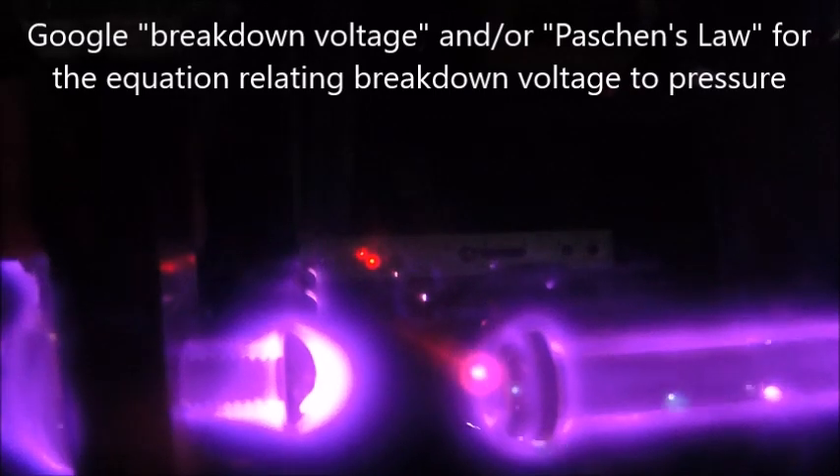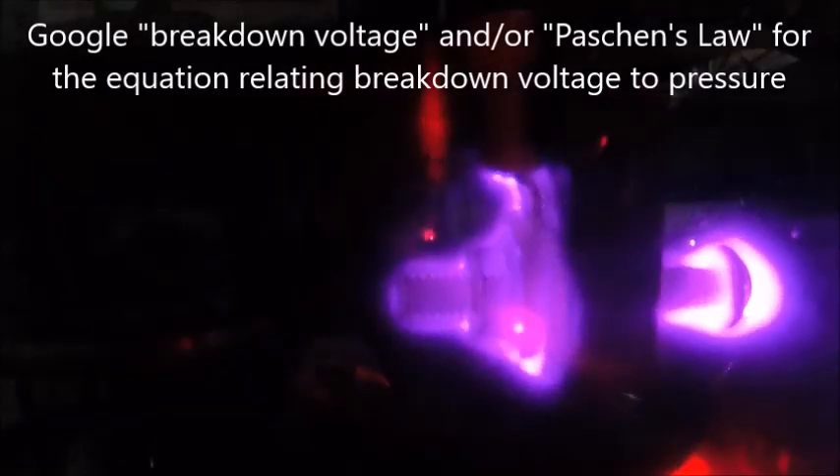460 — yeah, it's hanging at around 440-450. Oh cool, look — the nut just engaged. Whatever air in there must be ionizing because it just started encompassing the rest of this area. 440, 441. It's supposed to be producing 3,000 volts, but apparently in the vacuum the transformer just supplies more current. It's not able to supply a higher voltage because the ionizing gap prevents it from reaching the full voltage.